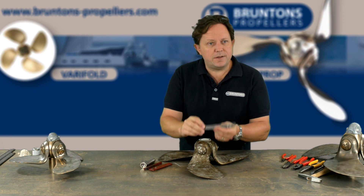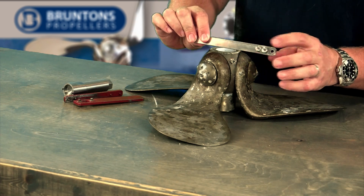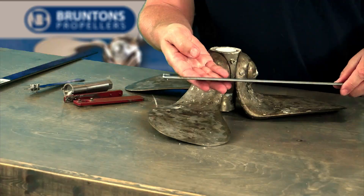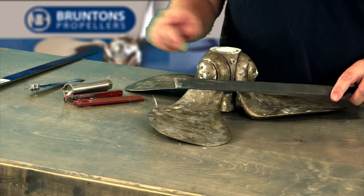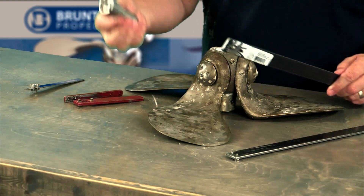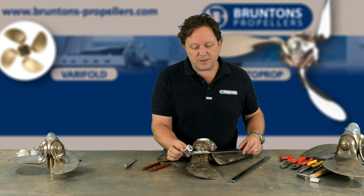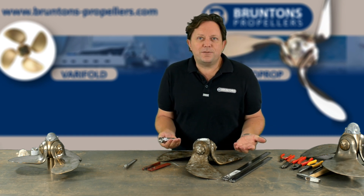Over the years I've actually made these myself. This is just a bit of stainless with some cap head bolts, ground down on a grinding wheel. This one here is just a bit of steel bar from Home Depot, a couple of bolts in, ground down the same way — just measure the holes, very straightforward. This version here is for the H5. I had one in earlier, didn't have the tool as it was on back order, so I made my own. All they are in effect is peg spanners, so don't be afraid to have a go.